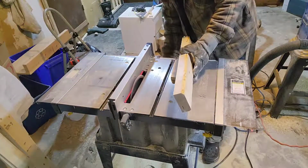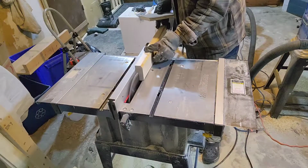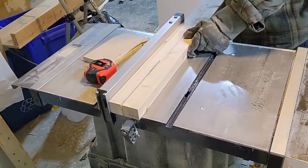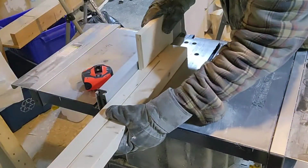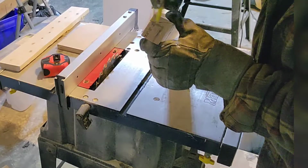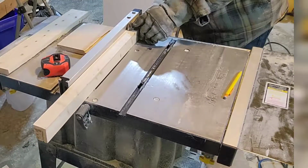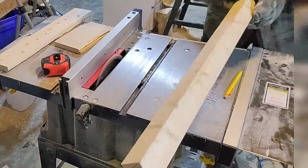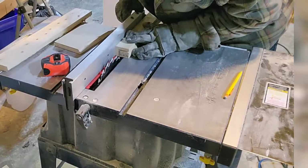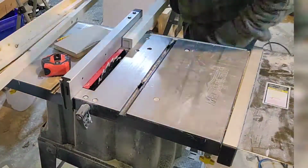Here I'm cutting the little pedestal part that will hold up the 5-foot stretchers. For the parts that actually hold canvas up, I cut a 1.5-inch strip out of a 2x4 and then cut a little L into it, or basically cut out a rectangular part out of that board. That's going to serve as part of my shelf, and that inner rectangle that I cut will actually serve as a foot. So that's about a 3-foot long piece, which is about the width of a canvas that my wife normally paints on.